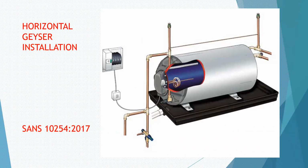I believe, as I've said initially, it's the way to go. There's no other thing to do. You have to do that. I just want to explain to you that if she asks you why 900, you can say to her, ma'am, that pressure of 900 kPa is based on the premise of 1 meter rise from ground level represents 10 kPa. The reading of 900, if you divide 10 in 900, the answer is going to be 90. So that water source is 90 meters high, vertical height. You remember what I said in the beginning.